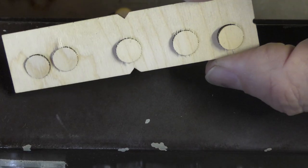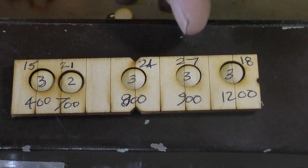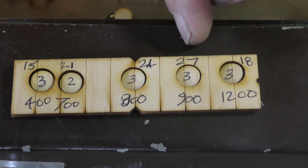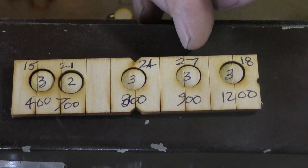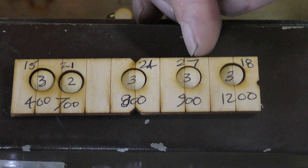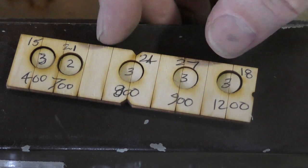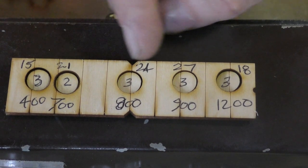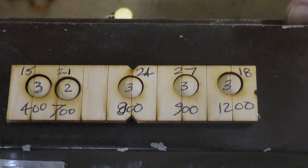The outer positions with very large blunt beams show cutting dropping off to 18 and then 15mm/sec. I don't think there's any doubt that larger beam equals worse cutting. I tried to judge these so they would nearly all cut through and I've looked at the back. I didn't push them out - I wanted to keep them in for reference. This is quite amazing because I'm only able to get 35mm/sec out of my 70-watt machine, and here we've got 27mm/sec from this 30-watt tube. I'm on the way to making this machine into a cutting monster.